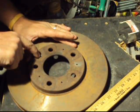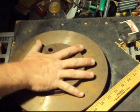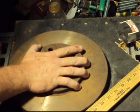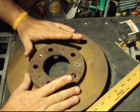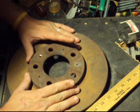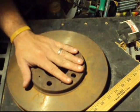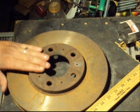If I cut out this much metal from right here and here and then one over here, I've got five holes. The reason why you want this to balance — this whole piece is balanced, everything on this rig is balanced so far. On an engine, on the crank, it has counterweights to keep the crank from getting messed up. The harmonic balancer can't take care of all of it. You don't want to say we'll balance it when we put the blades on — balancing it when you put the blades on is one of the best things you can do and it is the last thing you do. But keeping the rest of the unit in balance keeps the crank from breaking. You don't want the stress of any imbalance on this giving an imbalance on the blades to fight it in high wind. A smooth, balanced machine throughout will run for years.